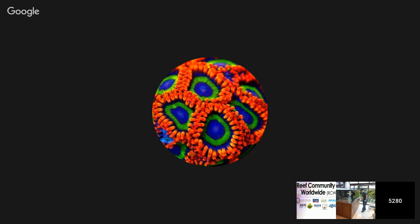And we're saying, as in metal halides, the light bounces around because it does come up from a single source compared to LEDs. LEDs, you have individual spectrums, as in the diodes, like your 460 nanometers, your 440, your different ones, right? And what all these LED manufacturers have been trying to do is create these pucks or these lenses that blend the light together. But that's still not the same effect as a metal halide or a T5, where it produces the light from one single source, and that single source of light has those different spectrums inside of it. So it's like having one diode with every single spectrum in it. Once they can do that, I think LEDs are going to be the ultimate way to go, point blank period.